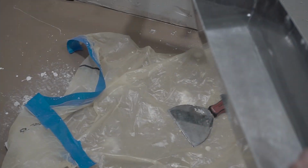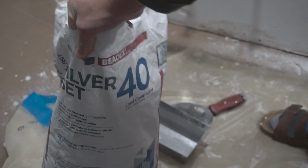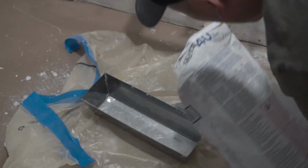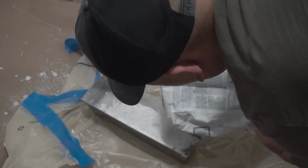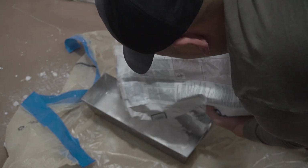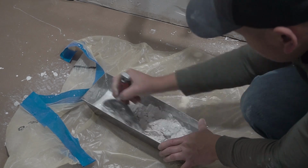Now the joint compound that I'll be using today is 40-minute mud. This is one of the best ones that I like to use because it gives me ample time to mix it and then work around it. Now there are other faster setting muds out there. There's actually a 5-minute if you want to have it set a little bit faster, but 40 is pretty much best for me. If you like working with more time, there is 90-minute mud. Again, I'll leave those links in the description down below, if you want to get access to those mud types.